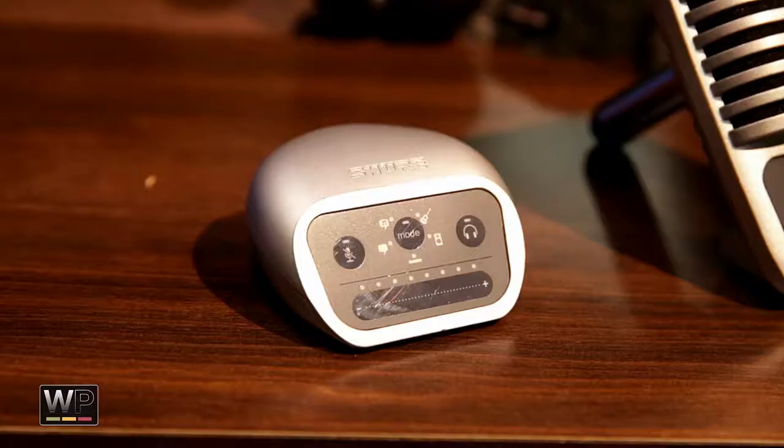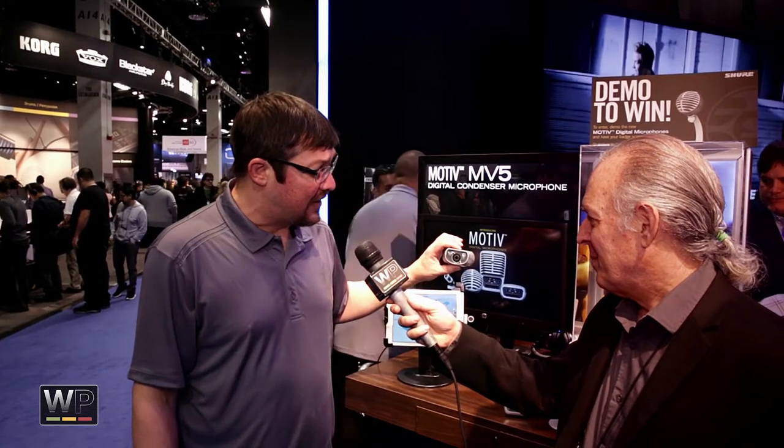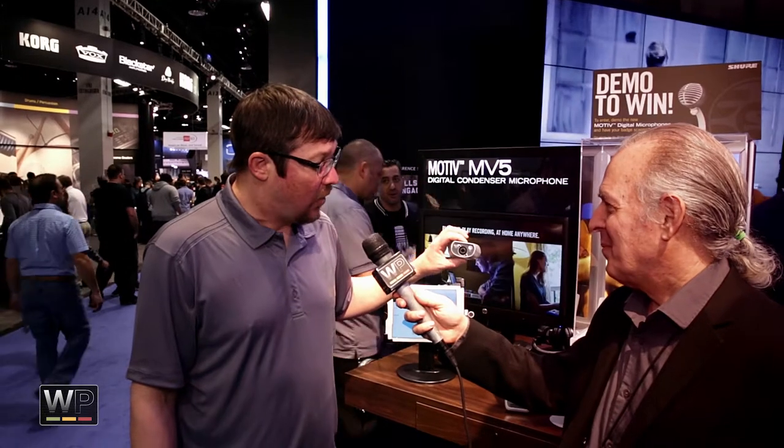If you've got your own microphone or guitar and you're just trying to get into an iOS device, a DAW, or your laptop or desktop, we've got a single channel interface. It's got the same cap touch panel, the same DSP modes, and 36 dB of adjustable gain. On the back it's got an XLR combo connector so you can plug in a quarter-inch instrument or an XLR mic. It supports 48-volt phantom on USB and 12 volts of phantom on iOS. With the USB cable it's $99; with USB and lightning it's $129.